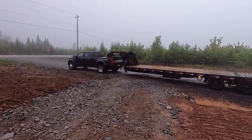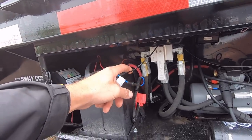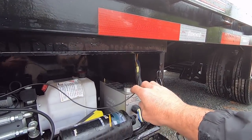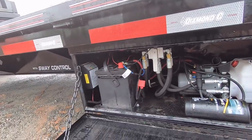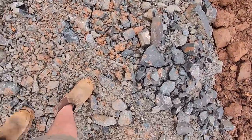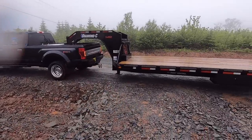I'm gonna get the 080 loaded up with the mulcher on the front. What I wanted to show you is what I did to get the 12-volt: I went off the positive battery terminal inside the box and ran it straight over, tapping into the 12-volt coming to the actuator — so now it has constant 12-volt, which we should have been getting from the truck anyway. That was my workaround for what I've been dealing with.